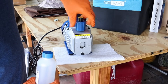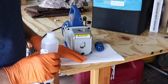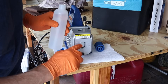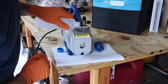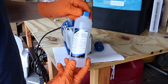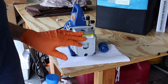Before we hook up our vacuum pump, we're going to make sure it has oil in it. You can just use the oil that's supplied with the pump — this can get a little messy so I'll put a paper towel under my pump. I'm going to pour oil in until it gets close to the maximum level; you've got a min level and a max level. It almost took this whole bottle of oil, and our oil level is almost to the max line. Very important to make sure this pump has oil or it'll burn itself up.